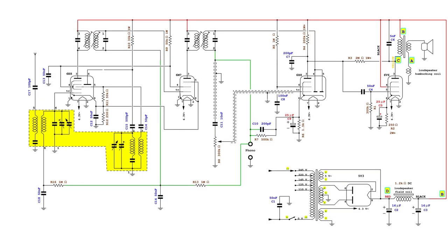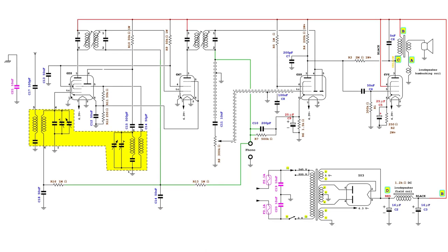This is the reverse engineered schematic diagram of the original arrangement of this radio. During the restoration, it has been slightly modified, disconnecting all input voltages except the one for 245 volts, including two fuses and two noise filtering safety capacitors. Also, the chassis has been isolated from the antenna ground as an extra precaution, in case somebody disconnected the ground connection from the power plug. Nothing has been done to the phono input or pickup, as it is unknown the reason why it wasn't coupled with a capacitor. However, it should not be used, and the corresponding hole on the back panel will be closed.